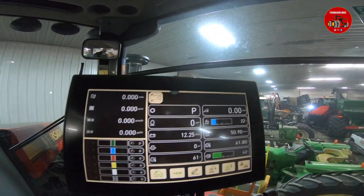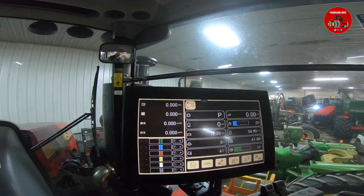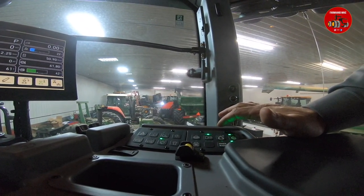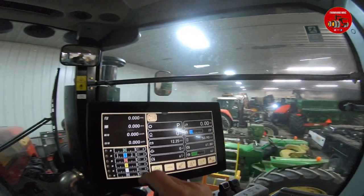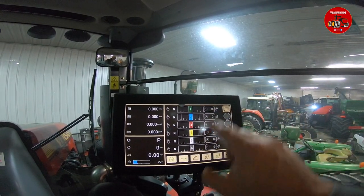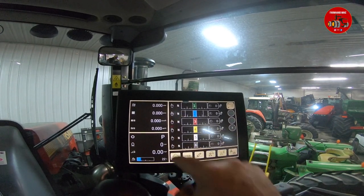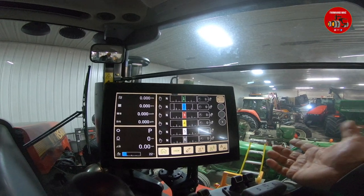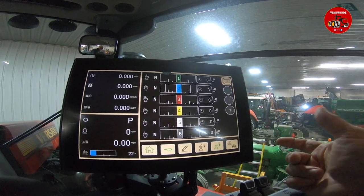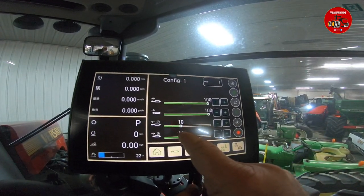So I've got the screen set up with three different sections, and we're going to go through hydraulic adjustment. You do have to turn the hydraulics on with the button here to activate them — otherwise they will not work. This tractor has six remotes, so we can adjust each remote individually. Right now each remote is set in manual mode. We can run this in manual, continuous flow, or time detents. If we want to adjust valve number one, I'm just going to press and hold on that.